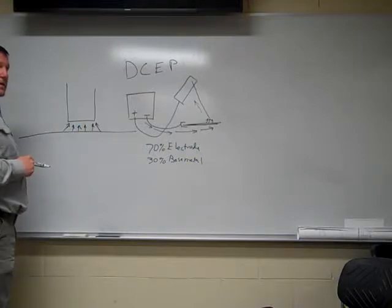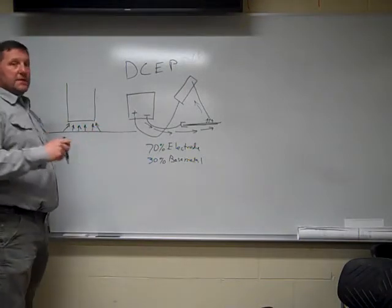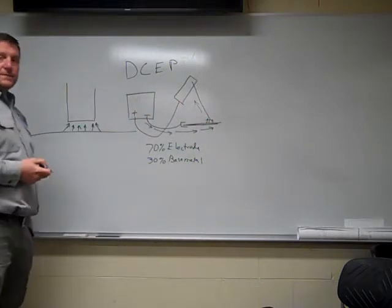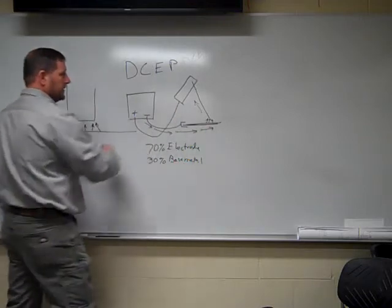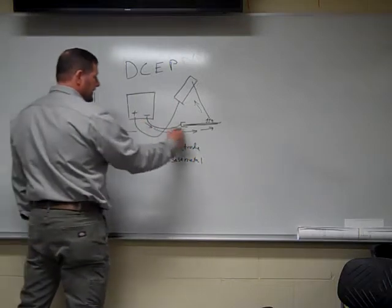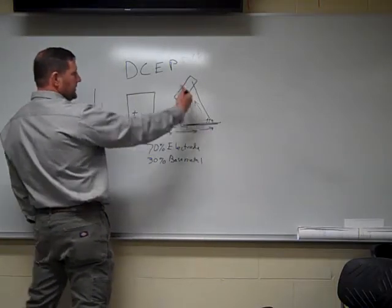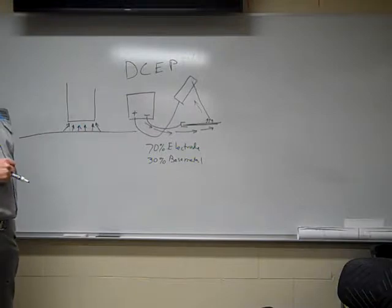in creating that fusion. Now just the opposite in TIG. Primarily in TIG, we run DC electrode negative. It's because we do not want to burn our tungsten electrode. So kind of keep that in mind. It's all about that circular current. It's going to generate a circle, a magnetic field, negative to positive. So all our electrons are going from our ground clamp up into our electrode, creating a lot of resistance. Therefore, that's where we get our fusion.